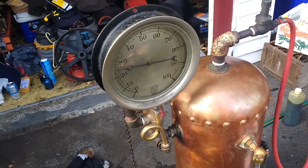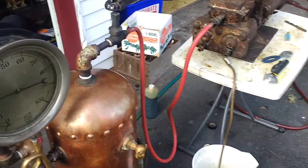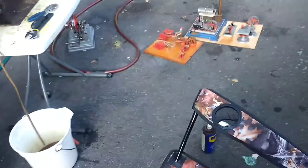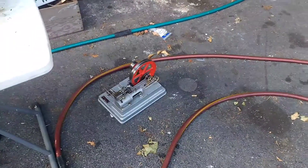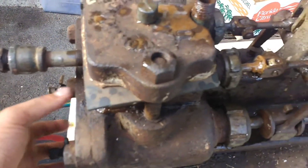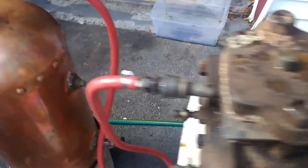As you can see, it kept right up at 25. It's pushing the limits of it because there's not a whole lot of heating surface — it's just a little pot burner under there. It powers a large tabletop engine just fine and will do that all day long. But a big steam pump with two 3-inch bore cylinders by a 3-inch stroke — that's a little bit more of a task.